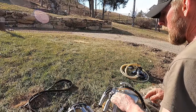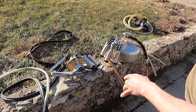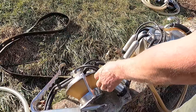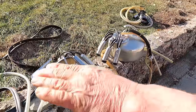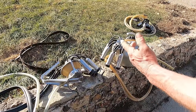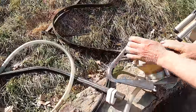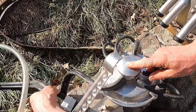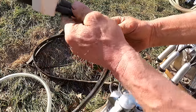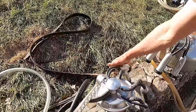My vacuum is set at exactly 14.3 — you may be 14.2 or 14.4 but that's it, there's no more tolerance. There's a vacuum level controller in the system that keeps it exactly at that. The key is to keep the vacuum level at the cow's teat end exactly the same as the days and months and years go on — your cows get consistent with that and they milk out more evenly. They were good for vacuum control but had single pulsation, meaning all four would pulse at the same time.